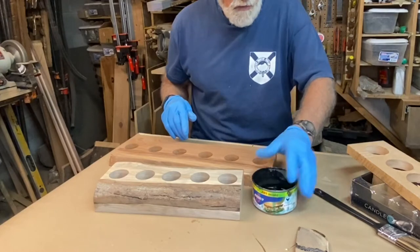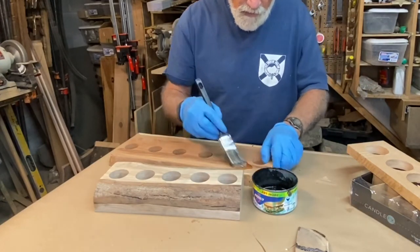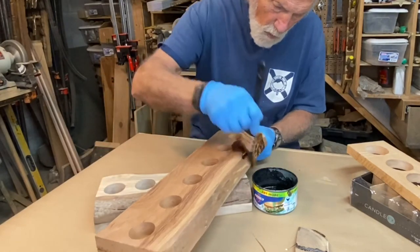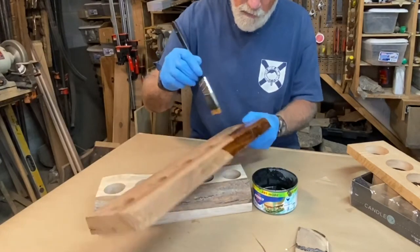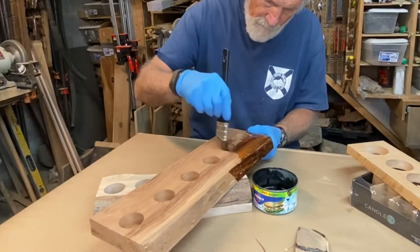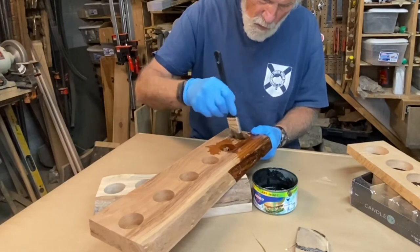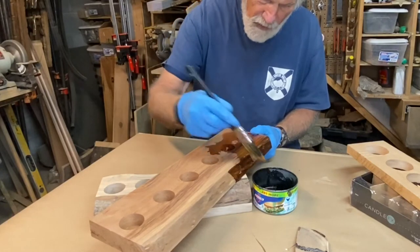So now I'm ready to put a finish on them. On these, I'm going to use an antique oil finish. With this, it just really brings out the grain. You brush it on or wipe it on with a cloth — either way. I'm using a brush right now because I need to get down in here and get the edges. You wait about 15 to 30 minutes, and then you wipe off the excess.